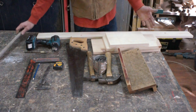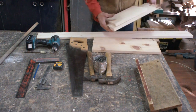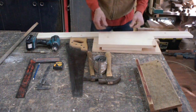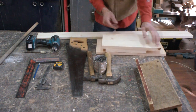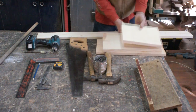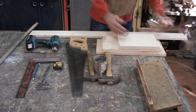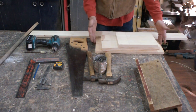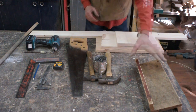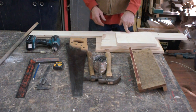The size is just whatever size toolbox you need. These are some bits of scrap I just picked up off the shelf and they're all the same width — that was important for me. I've got the bottom and the ends, and then the sides of the box are just a different width board. The length and width doesn't really matter; whatever you've got will determine the size of your toolbox. You can also use a bench hook to hold your work while you saw it.